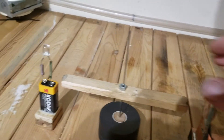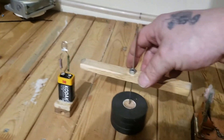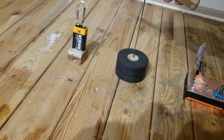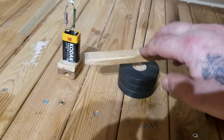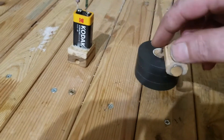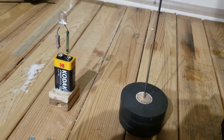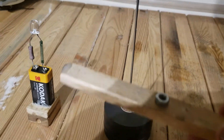What this actually is, it's a rotor — it's actually a pulse motor. This is the rotor, and it's just a piece of wood with two magnets in the bottom that floats upon another magnetic field from ring magnets below, so it's very low friction. On the ends there are a couple of neodymium magnets at either end, and what we're doing is using something called a reed switch, which is a magnetic switch — basically when the magnet comes closer to the switch, the switch switches on.